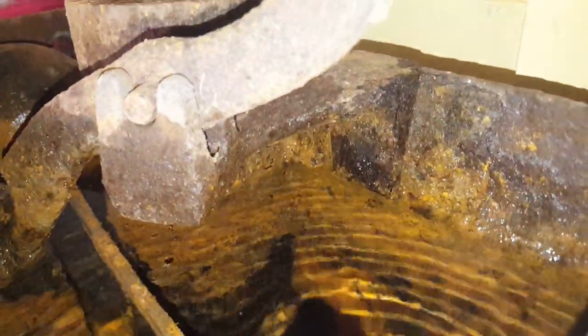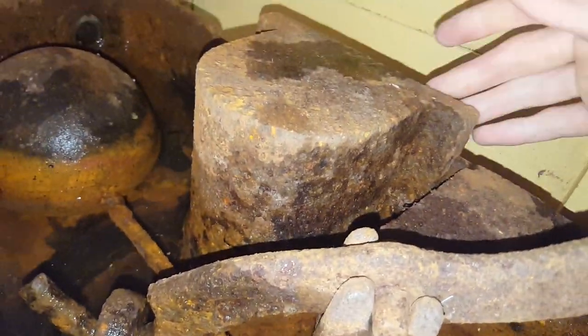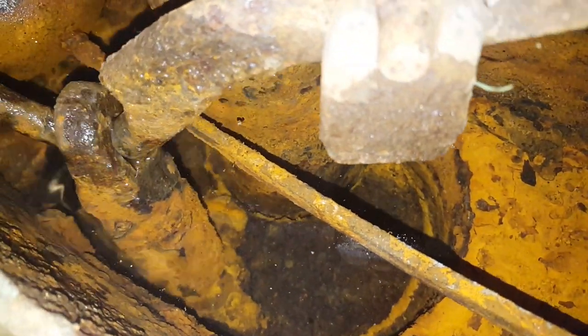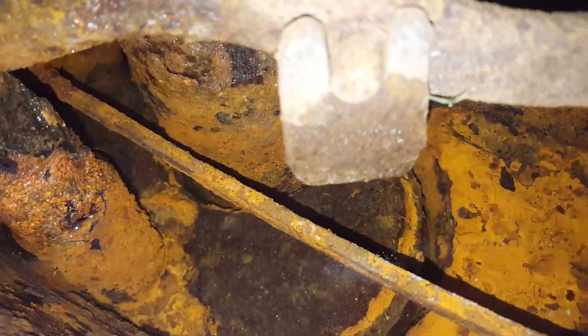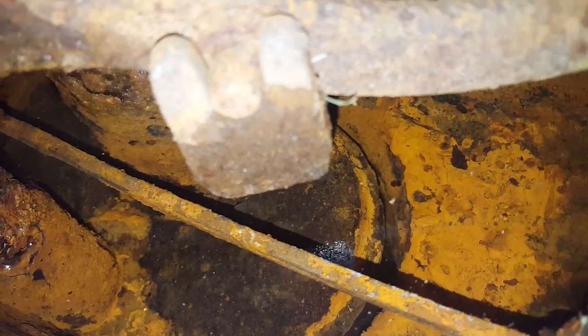Unfortunately I'm quite limited on what I can clean up for this system. I'm going to have to take this off in order to remove the weight block. I can easily lift the bolt out like this, but there's no chance I'll be able to remove the dome, so I'm going to have to work around it, like I did with the siphon. Thankfully the rust in here is quite loose so I can get that off okay without too many problems. It is a little bit worn at the side, so reliability isn't 100%, but this will be resolved somewhat from painting, and if I have to I can fill the edges around with milliput.